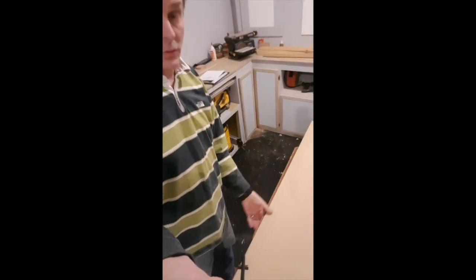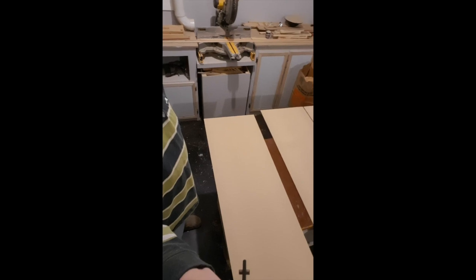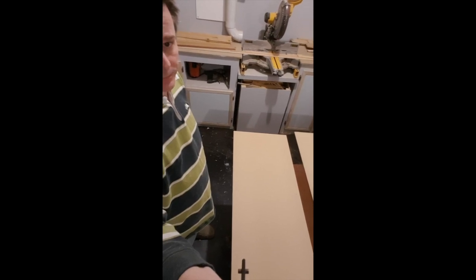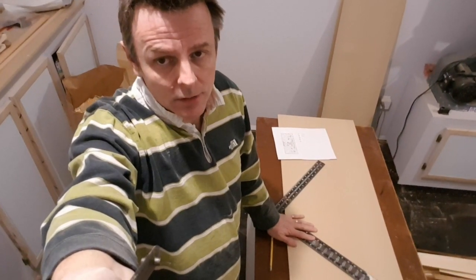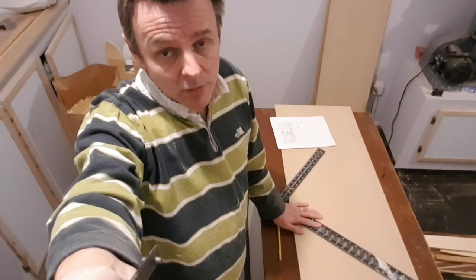For this project, you're going to need a backer board. I took a quarter-inch MDF sheet, four by four, and cut that into three sections, 16 inches wide each. That just happened to match my project best, but it'll depend on what your project requires. It gives me the three panels I'm looking for, and you want the backer board so that you've got some way to glue your strips on and hold them in place. I'm going to find the middle of this board, start laying out my pattern, and then cut it off where it fits after I've laid the pattern out.